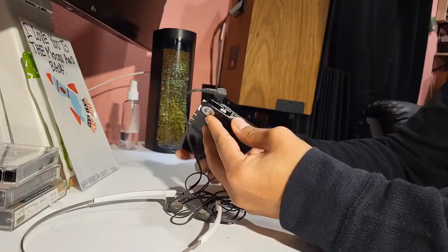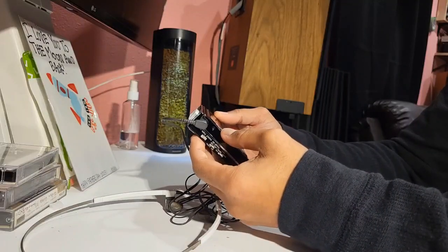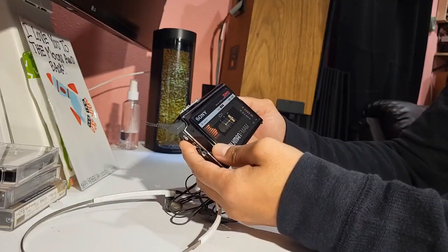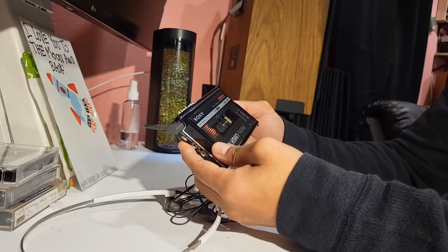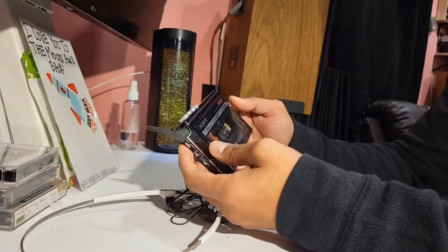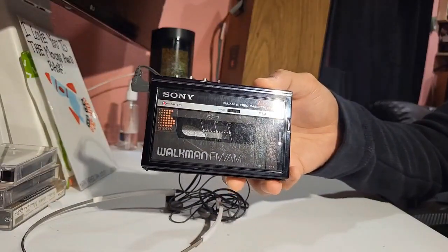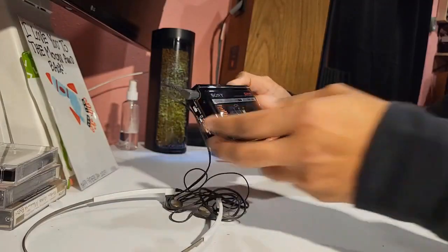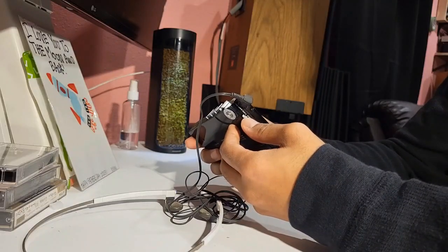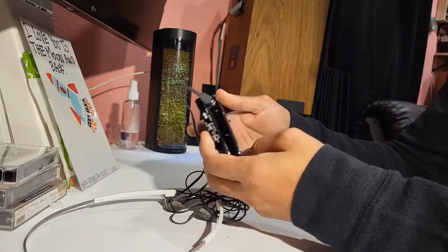I made sure to plug it through my current control DC source first. That's what I typically do for all Walkman. A lot of times they have corrosion and it causes all sorts of short circuits, and you don't want to damage them. So I typically put 1 amp as a current limit, and then give the actual voltage. Ensure the polarity is right, of course. This is a beautiful unit. So it passed that test, and as soon as I put a battery in and played the radio, also on the current controlled voltage source, everything was all right. So I'll work on it.